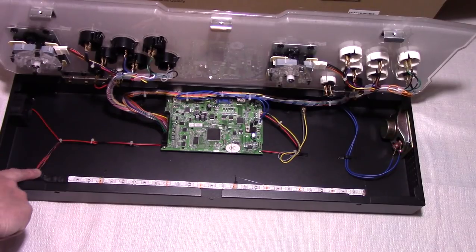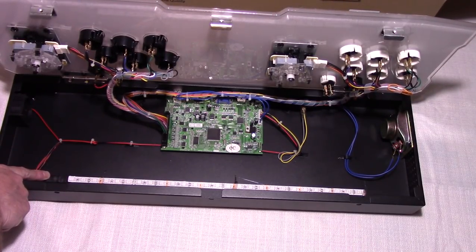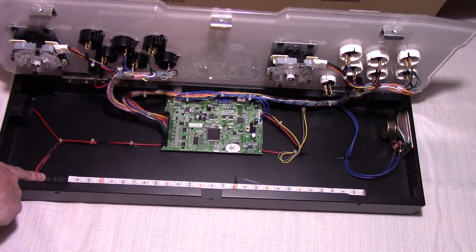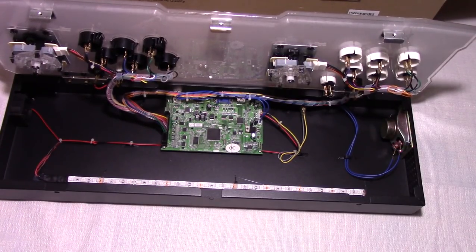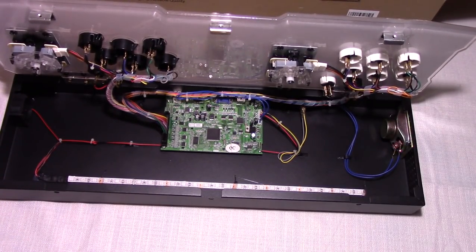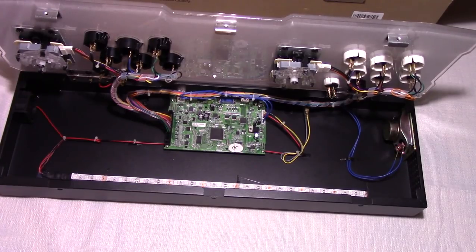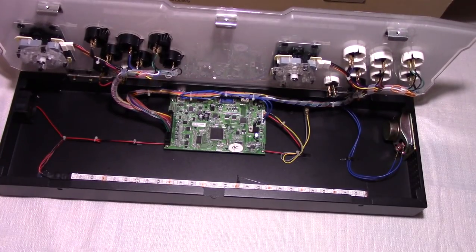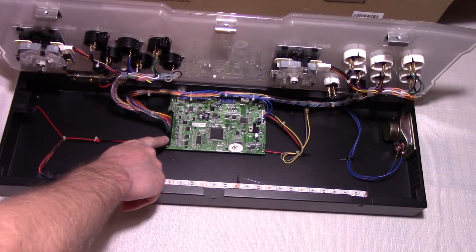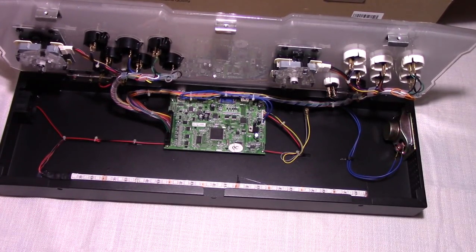I do see one thing that's kind of weird over here on the side. Got this heat shrink over the LED strip on this one end, and it almost looks like that must not be an LED right there, like it got covered up, but probably not. This is supposed to be an RGB light strip, I think. It's supposed to change color, so that's probably the circuitry to change the color of the LEDs. Looks like we got some unused pins right here on that little computer board.